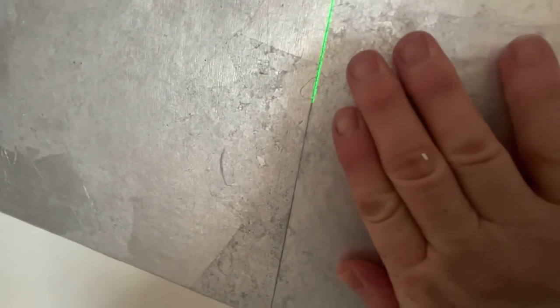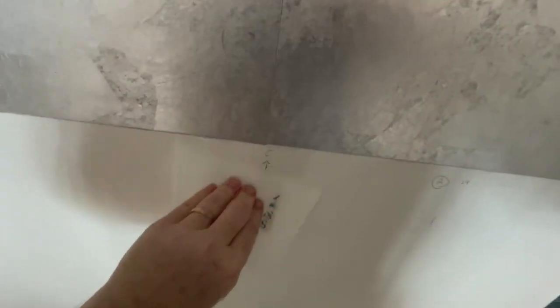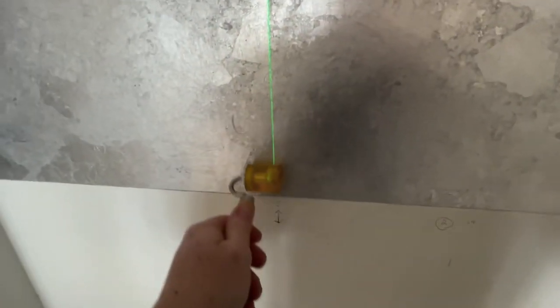The other advice I would give you is to know your seam. What do I mean by that? Or know your best seam. What I mean by that is you can overwork your seams. Now, this is fine wall covering, but you can take the paint off of this if you work the seams too much. Now look, watch the seam. I'm pushing it closer. Now I'm overlapping it. What I started out with was my best seam. You can work it too close where it starts pushing up toward you. And you have to know when to lay off. And if you know when to lay off, your seam is going to look gorgeous.